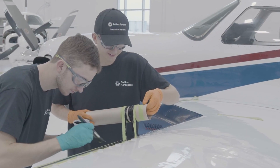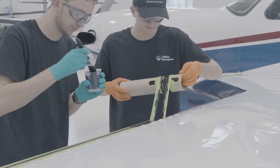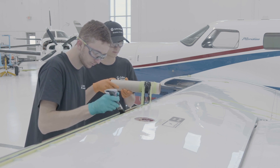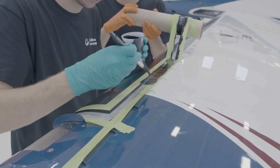Using a clean half-inch brush, apply an even coat of conductive edge sealer. To maintain a clean edge, an assistant should immediately remove tape once the edge sealer coat is applied. To ease tape removal, attach the ends of the masking tape strips to the cardboard cylinder that you set aside when opening the new de-icer.